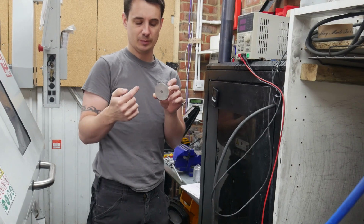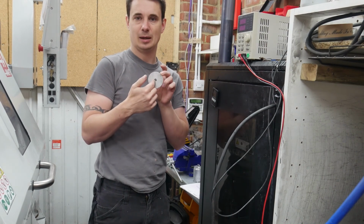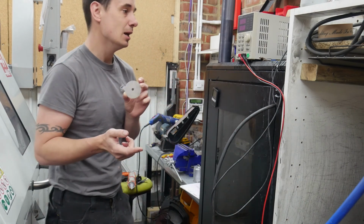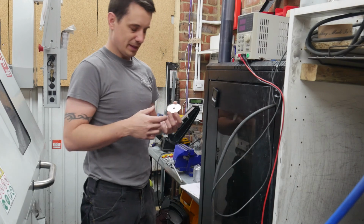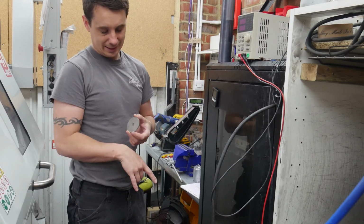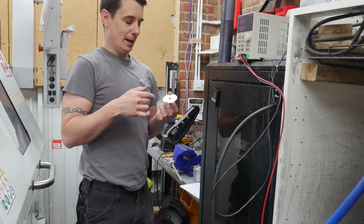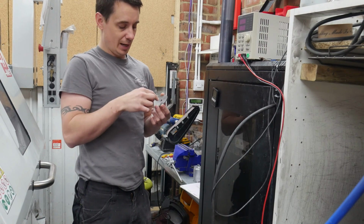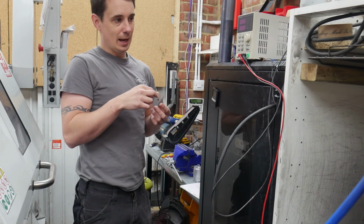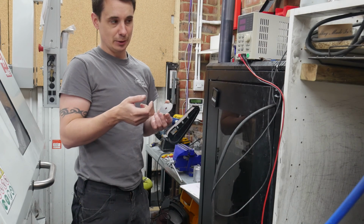That's from the lasering company, and then when it arrives to us we just have to tap this hole to M10 fine, M10 by 1mm. And then we've basically already cleaned this in an ultrasonic cleaner. We've pre-baked, so now the next step is that we have to actually mask off the thread and powder coat.